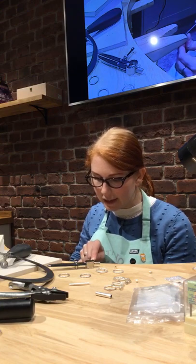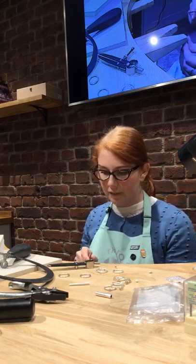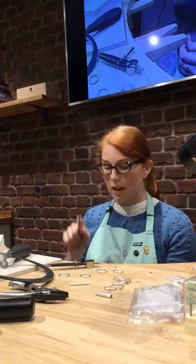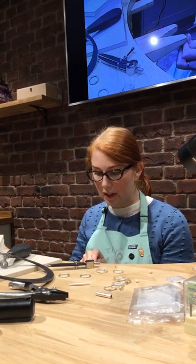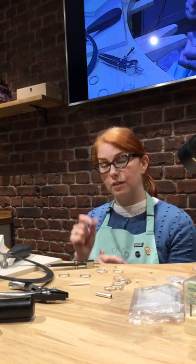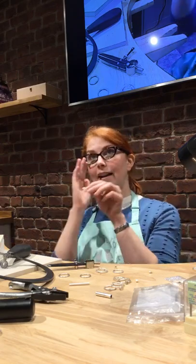And we're doing things like this. You want to make sure you turn it, because needle files are tapered, so you've got a wider end and a thinner end, so you're not going to be putting as much of a groove in one side than the other unless you just turn your tube and then do it. So I should have done that and then cut through.